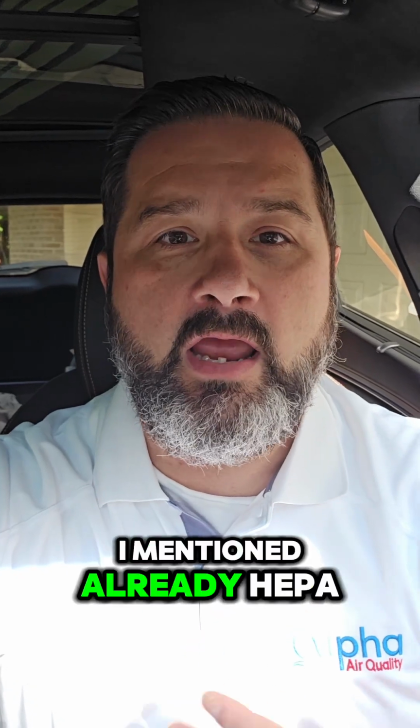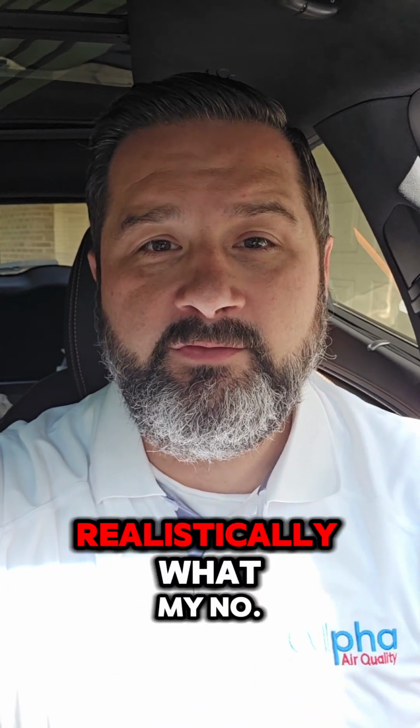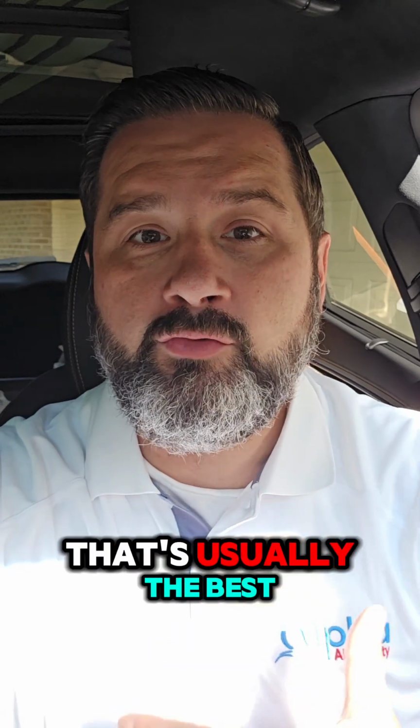There's just a lot better ways we could do this. I mentioned already HEPA vacuuming with an oscillating sander before in a video, and I think that's the best way. Realistically, what my number one recommendation in an attic is to just replace the attic sheathing next time you do a roof. When we're talking about incremental costs, that's usually the best way that you can do this, depending on when you're going to do a roof.